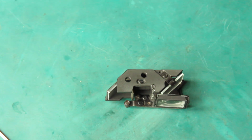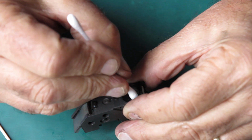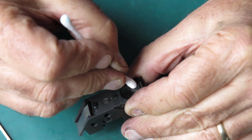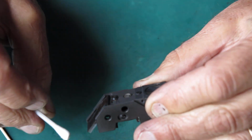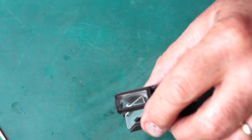Well, looking through it, it looks fairly hazy. It's a very cloudy day here today. When it's a low contrast situation like that, you don't notice problems with the finder that you would see on a bright sunny day. If you have a bright sunny day, you may well find that the bright light will reflect nicely off all the hazy surfaces in your finder. Let me have a quick look after cleaning that rear glass. Yeah, well, that's certainly improved it to quite a large extent.